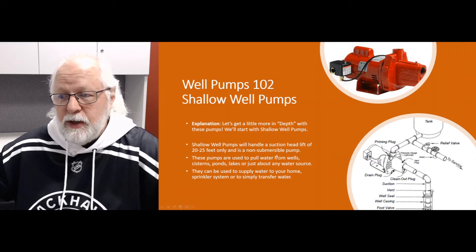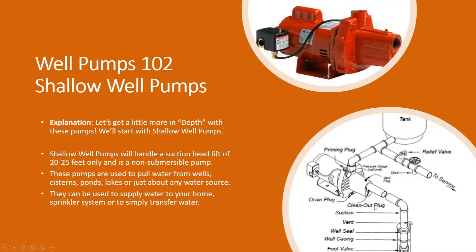These pumps will pull water out of anything — whether it's a well, a lake, a pond, or any kind of water source. Anytime you can minimize that suction lift, that's going to be good for the pump and give you better performance. In the case of a pond or lake, if you can minimize the lift to about five feet or so, you'd be doing the pump a great service. It's always easier for the pump to push water out through the discharge than to pull it in from the front.